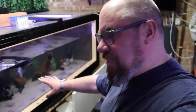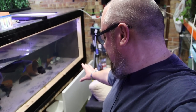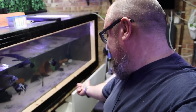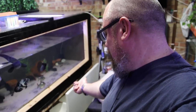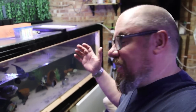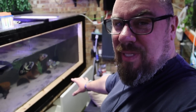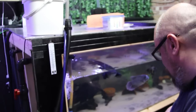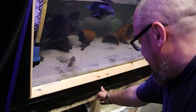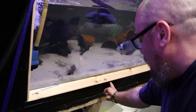I've been investigating where the leak's coming from — it's definitely only coming from here. I've been underneath all the way around checking there's nothing from any other areas, and it wasn't until I came back out from underneath that I noticed the overhang. It's almost a centimeter of overhang and it's all that pressure pushing to the front. I've been going through all the old videos when I was constructing this and I suspect it's something as stupid as I didn't put enough screws in — there are actually two separate wood struts and then the base, so I think I've just not screwed them in enough or used enough screws.